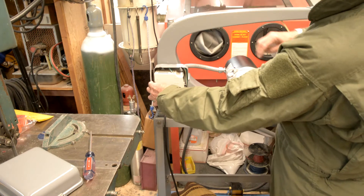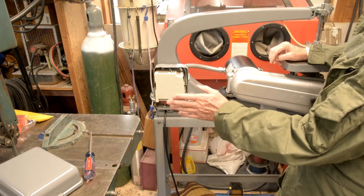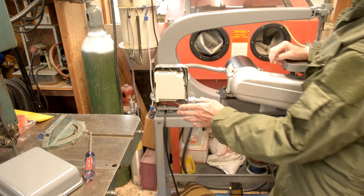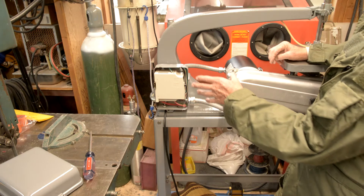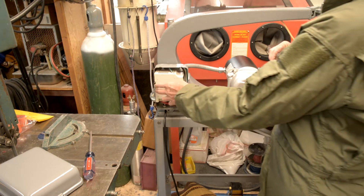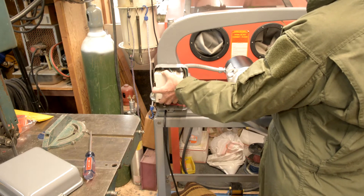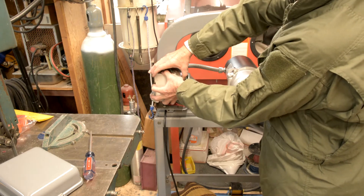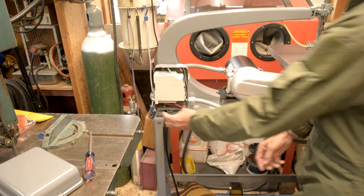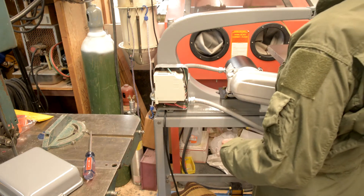I put a piece of DIN rail in — if you need to know what DIN rail is, look it up, but it's a standard mounting configuration for relays and things like that. This VFD snaps onto it and will also slide out so I can program it. There's a little plastic clasp in the back — slide it down and it'll completely pop off.